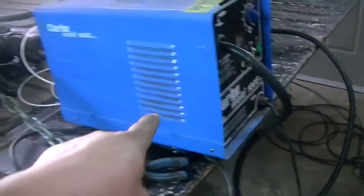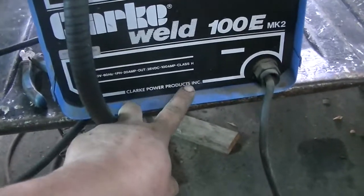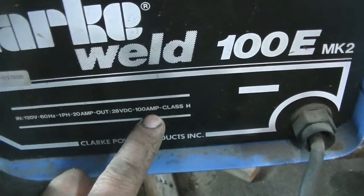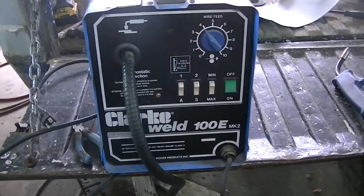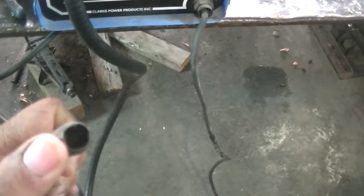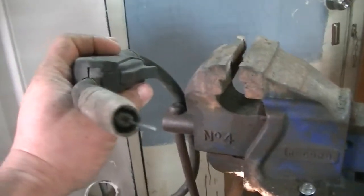And we stumbled upon a cheap, small welder too, but based on this, it has 100 amp. So it's an Italian made MIG welder, but it has a problem. The wire that's supposed to come out on the tip, just like this one, as you can see, the one we're using, is getting stuck somewhere in the line.